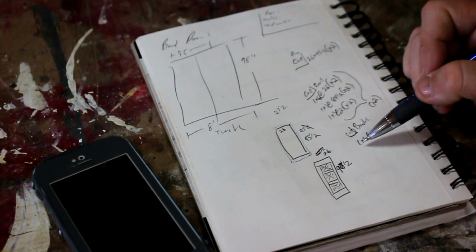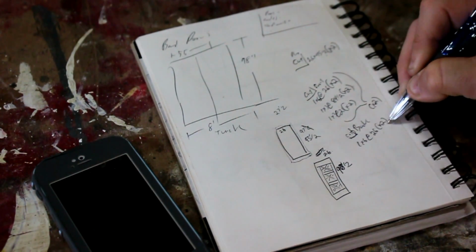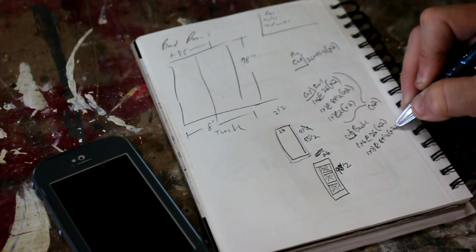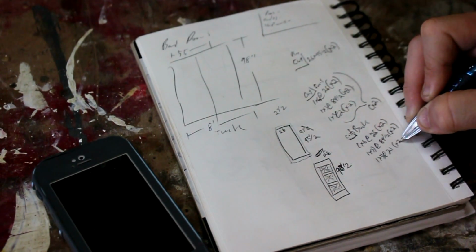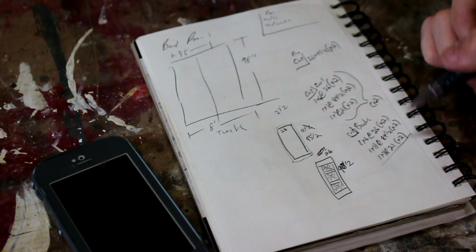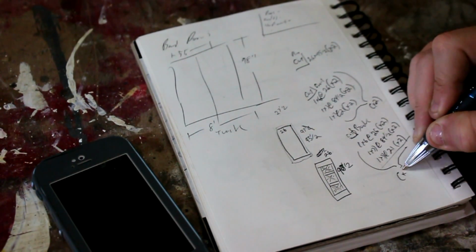Now let's figure out the back. The 1x6s we're going to have also at 26 inches, top and bottom there. 1x3 at 84.5 times 2 of those, and also 1x3 at 21 times 2 of those. The back is not going to have the cross beams, so that's it. We're done for the back. Again, all of this, 2 doors, so we have that times 2. All right, so let's get cutting.